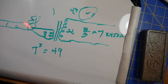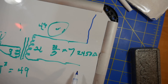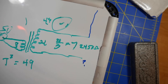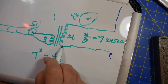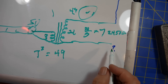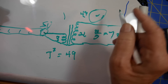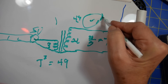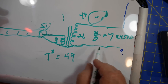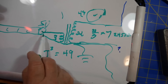Here's where people get confused. Here's your antenna right here. What do you do with this end? Well, let's talk about possibilities. This is connected to this, which goes on the shield. So any energy floating back this way comes out the outer shield right here. This can often serve as your counterpoise. You can do one of several things: you can hang a little piece of wire out here, you can connect this to earth, or you can use the coax shield itself.